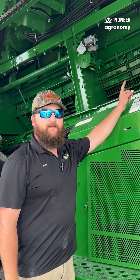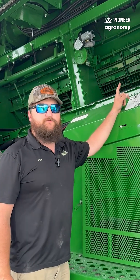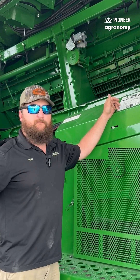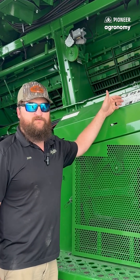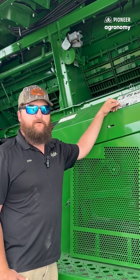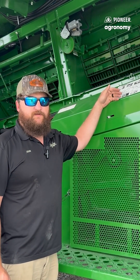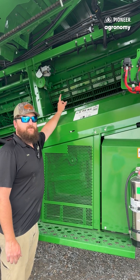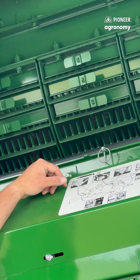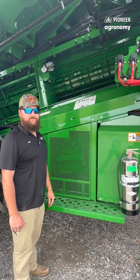One thing I wanted to point out here would be our separator grate covers. In this machine we have three rows of four in our separator grate covers. That is designed to allow the free grains away from the wall and drop into the middle of the machine. The centrifugal force of the rotor is going to push the grain to the outside edges and we want to keep them in the center. Our separator grate spacers are in a storage position — they're on top. For corn and soybeans they would be in the middle position; for wheat and Canola we stick them on the top in the storage position.